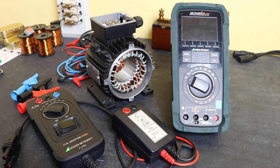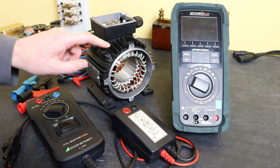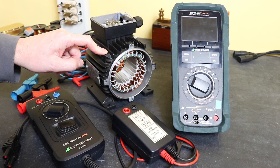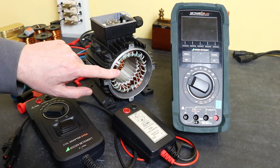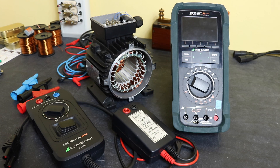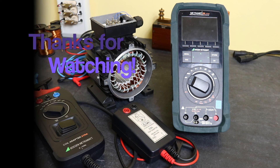That's the basics of the coil test explained — the best way I can demonstrate it with coils of wire. What I do plan to do in the future is try to get hold of another motor stator, preferably a 2-pole 3000 RPM one and definitely a bit bigger, so I can place interturn faults on it in various places and see how that affects the coil test readings — and compare against winding resistance and inductance measurement of the stator, which is another way to potentially find interturn faults that haven't yet developed into an earth fault. Thanks very much for watching, I hope you found it useful, and I'll see you in the next one.